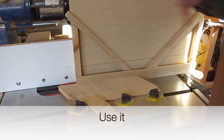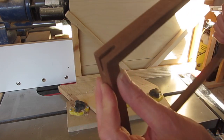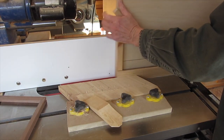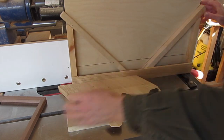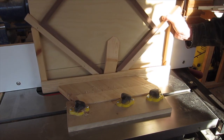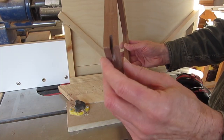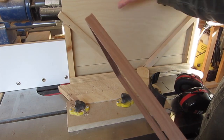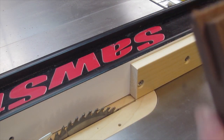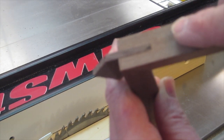A handy jig I use on the high fence is this thing for cutting slots in 45-degree picture frames to make splines. This hooks onto the high fence so it can't pull away, and then it's pushed in by a fingerboard which I wedge in tight. That cuts a predictable, uniform-width slot. I'll put a link below this video to another video on how I made this. Here's another style of auxiliary fence I use for trimming off the excess of a spline to get it close, so there's a minimum amount of wood left to be sanded or planed away.